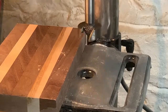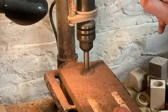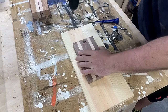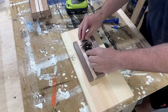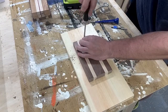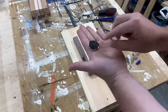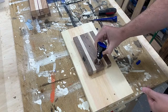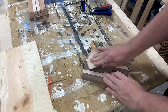Next I set the depth on my drill press so I wouldn't blow through the back — or in this case the front — of the board. Then I drilled the hole with a 1¼-inch Forstner bit. I'm also drilling holes all the way through the board since I'm using the same screws to mount the board to the wall and hold the opener on. I picked up some 1½-inch stainless steel screws that are the same size as the ones that came with the mount. Then I used some CA glue to mount the magnet in the hole.